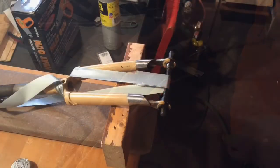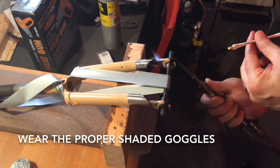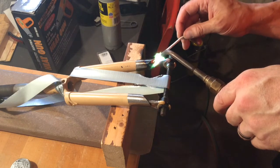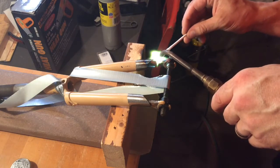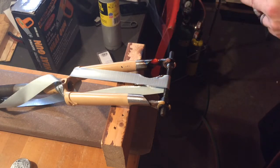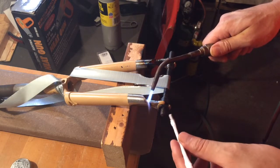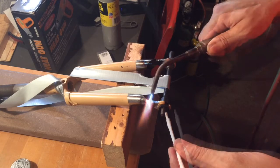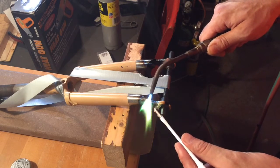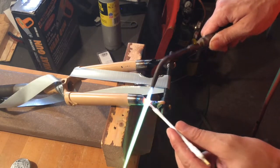Next I jammed the dropouts into the fork blades, positioned them where I wanted them, and used some duct tape as a jig. Yes, duct tape is flammable — something better is preferable, but I knew it wasn't going to move much. On the first leg I heated it up and then melted some flux into it. Then I went to the other fork leg, heated that up, melted some flux into it, and started brazing. I did a little spot braze on the left-hand fork and then went back to the right-hand fork, which was already partially heated, and finished up a spot braze on that one.